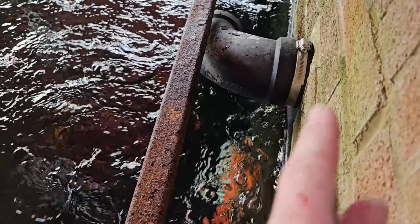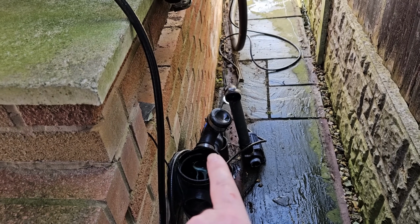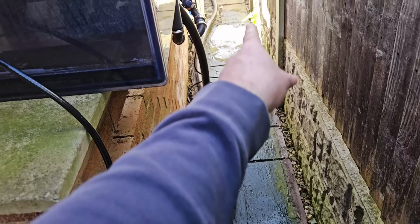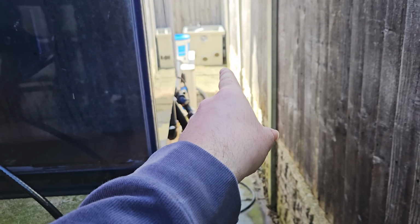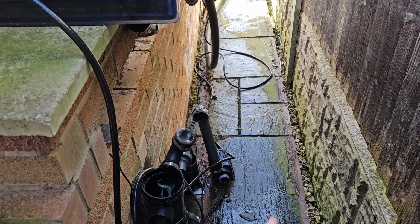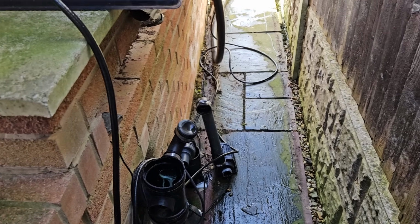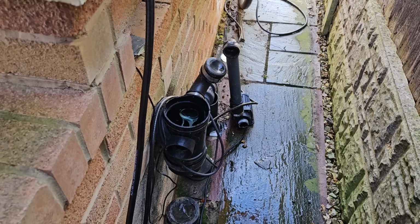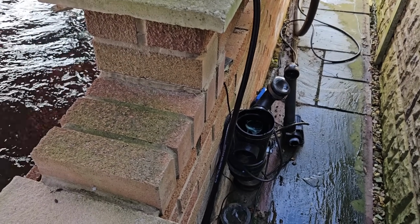Then it's going to come up to this, out through this wall, and I'm going to put a T-junction on here with a 2-inch ball valve on top where you'll stick a pond vacuum on it. Then it'll run down there, and there'll be a 4-inch ball valve just before it goes into the drum filter. You'll turn that off, stick your pond vacuum on that 2-inch pipe, suck all the air out, and then turn the ball valve on, and it'll just siphon, hopefully. That's the intention anyway. So let's have a go at setting it up, and then we'll get a closer look at how I'm going to do it.